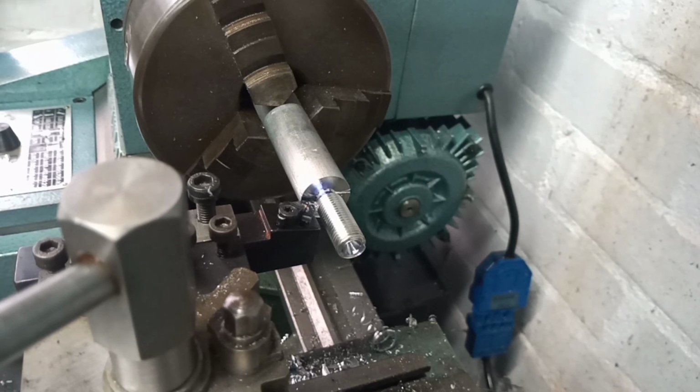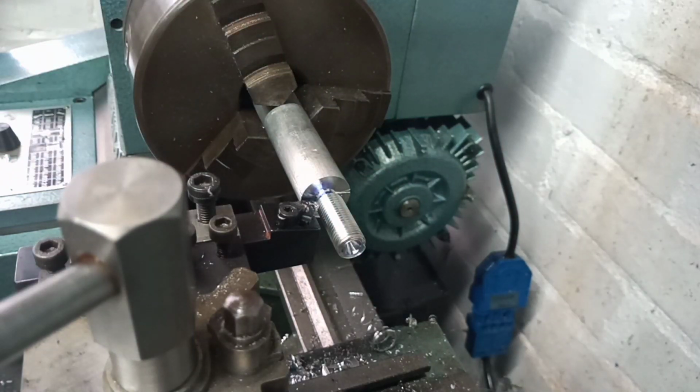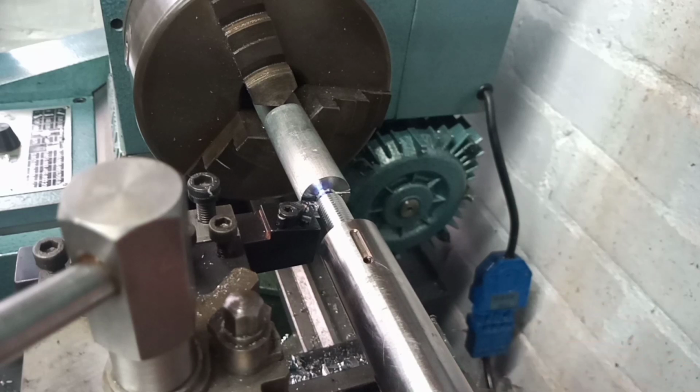Well, here we are looking at something in the lathe, and it's the test thread that I just cut. I had a bit of 7075 aluminium bar kicking around, so I just used that because it was convenient, and it fits. So there we go, the mystery is solved. Not metric at all, as I initially thought, but with it being a 60-degree UNF thread, the metric thread gauge did appear to fit. So there we go, let me show you. I'll try and keep my fingers out of the way. There we go. And that thread's on there as nice as you'd want it to.